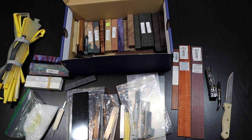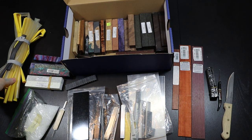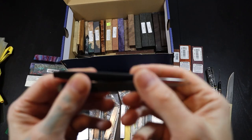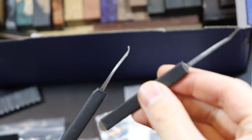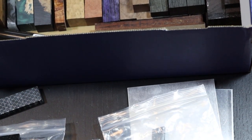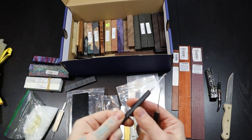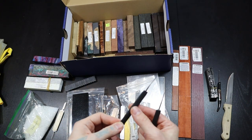There are a lot of options when making pick handles. Some of the first ones people usually reach for is heat shrink tube. Here you can see one handle with a single layer, and an old Sparrows one with a lot of layers. Heat shrink is not that useful because it dampens feedback — rubber kills off the vibrations. It feels good on your hands but kills the feedback, so I don't recommend it.